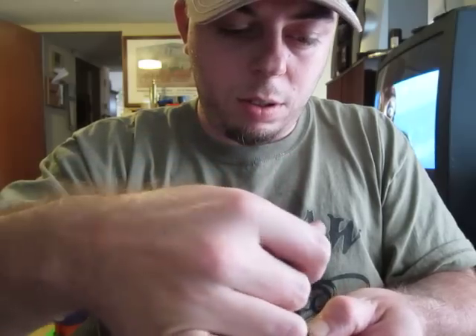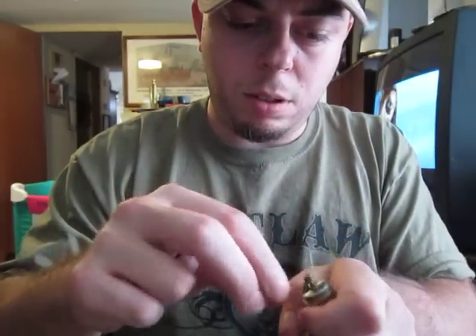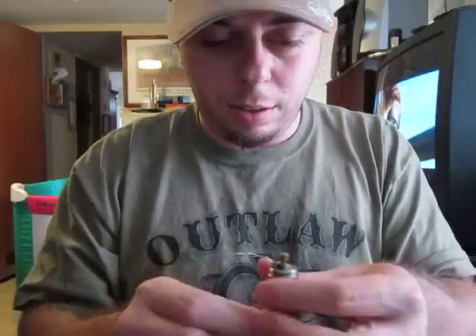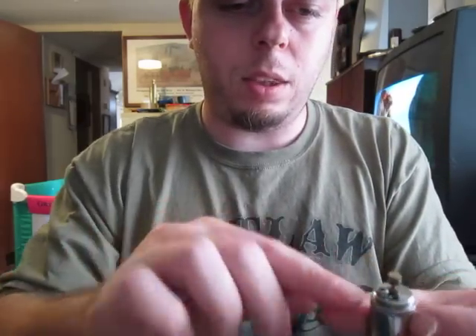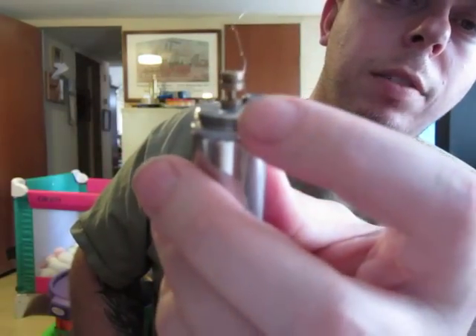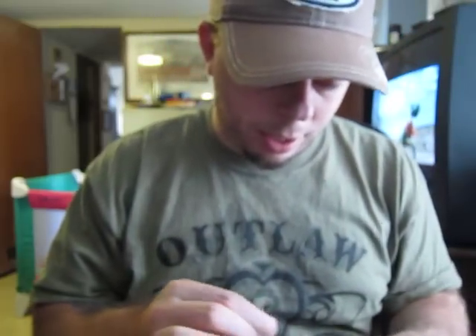It's really easy to do. Like I said, I don't wrap it around the screw — it doesn't have to be wrapped around the screw. The reason I wrap it closer to the positive post is because that's how we do Genesis atomizers; we wrap everything as close to things as we can. It just goes straight through in between the two posts so that the overlap on the screw head is holding it down. I leave my overhang so that if I need to adjust later on I can do so.